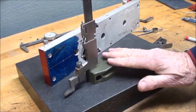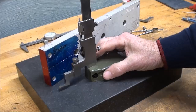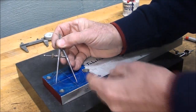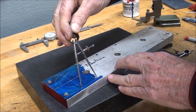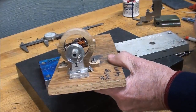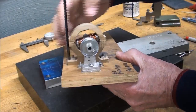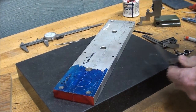Another starrett divider set for one-and-one-eighth. I love those starrett tools. I extended the centerline to go all the way across, which I should have done to start with. Now with the height gauge set for a quarter inch I'm going to lay out the base — I already changed my dimension from five-sixteenths, which might be a little too thick, but that's a matter of preference. That's the base, and with my dividers set for a little less than one-and-a-half I'm marking off the length of the base. The reason I'm making it a little wider at the base than the original is there's no clearance to drill the holes.